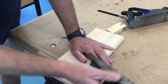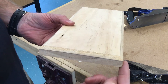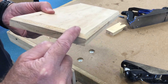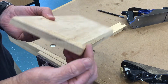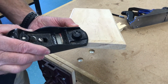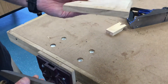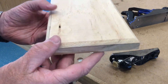The thing you need to be really careful of with the block plane when planing on the end is tear-out. The grain is running this way in the timber — if the blade cuts through to the end there's a chance it can rip the fibers off and create splits and chips. So if it looks or feels like that's going to happen, plane and then stop, then turn the plane around and come from the other direction, plane and stop.